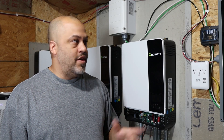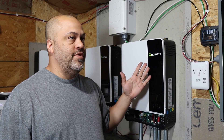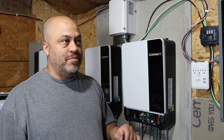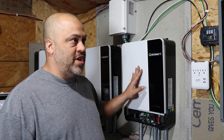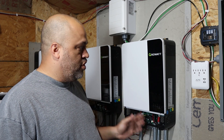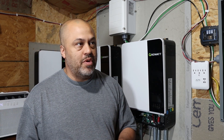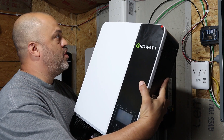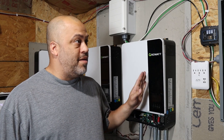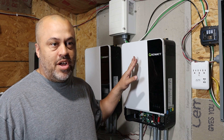I've been having this Growatt SOC problem. I moved around, took the ground bond neutrals out, and ran my inverters for about 18 months with only L1 and L2 connected — never had the ground hooked up. I talked to Citrus Solar, they told me to take the ground bond screw out of all the inverters and make sure I had the ground-neutral bond in my panel. Ever since I hooked up the ground from the AC output, I've been having problems with this inverter, including a zero-seven fault.